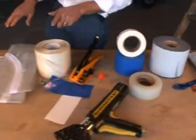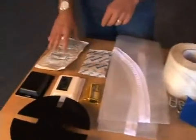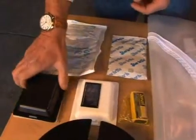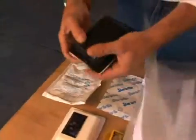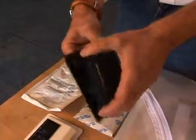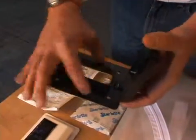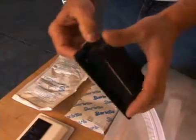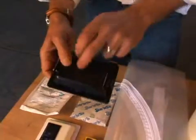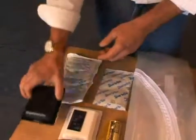As we step over here, shrink wrap does not breathe. It has no permeability, so it has to be ventilated in some fashion. Now this is a self-adhesive unit, two-part, so the top comes off, and you can see it has a wall on the inside. So this is weather tight on a horizontal or vertical surface. Easily installed, and it breathes very well. This is a passive vent.